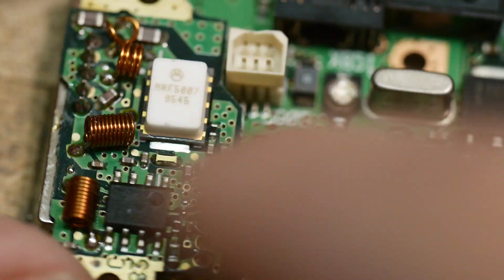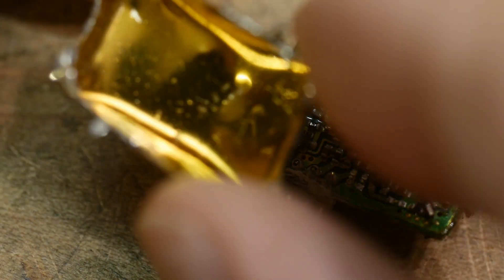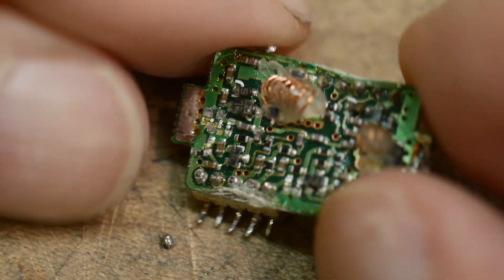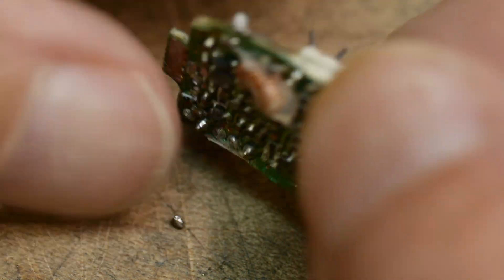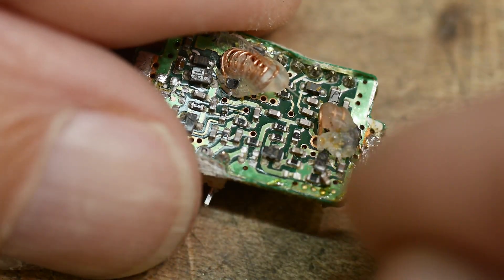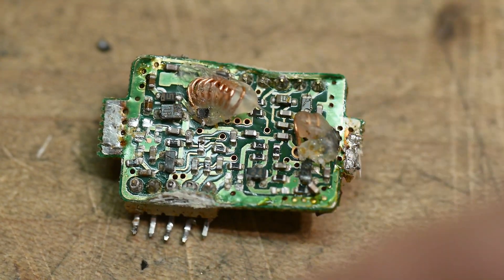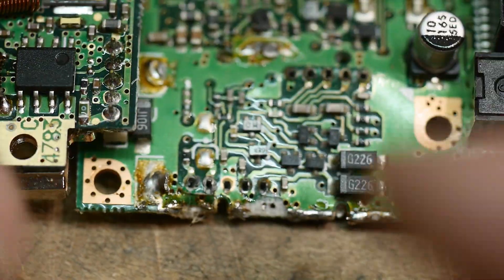Let's see if I can get underneath this can and see if I can get the power amplifier off. This is a nightmare to take apart — it had tons of solder on it. So this can — this is what was in the can: tiny, tiny, tiny little surface mount parts, some coils and stuff. This is probably the VCO, or part of the phase-locked loop circuit that the VCO is being controlled by. It's just super tiny. This is something you just don't work on. It was soldered down here, and there was stuff underneath it too. This board was on top of that board, with a bunch of stuff underneath it. There are just layers and layers of boards in this thing.